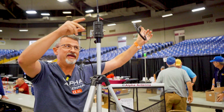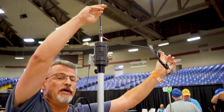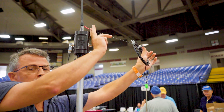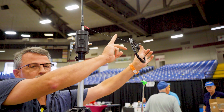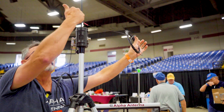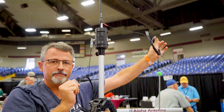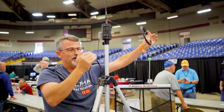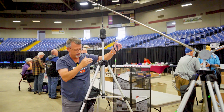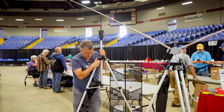Path of least resistance for a fan dipole — we already have the off-center fed here. Here's one element for the higher frequencies, a little bit longer element for 15 meter and 20 meter frequencies. For 40 and 80 meters, the combined length of these two elements gives you the third elemental length. That gives you a 6 through 80 meter off-center fed vertical fan dipole that does not need a tuner, going on this monstrous tripod that will support 200 pounds.